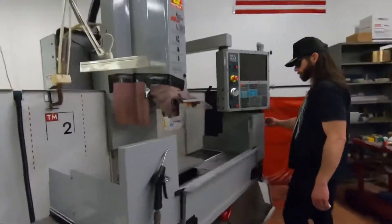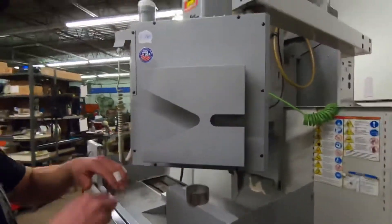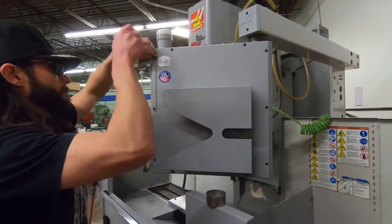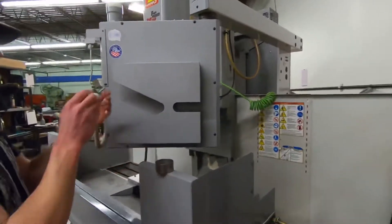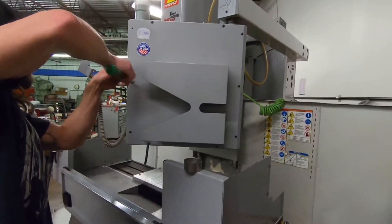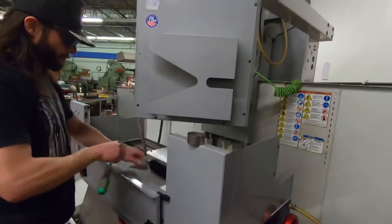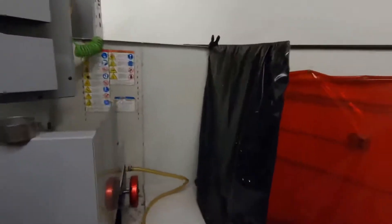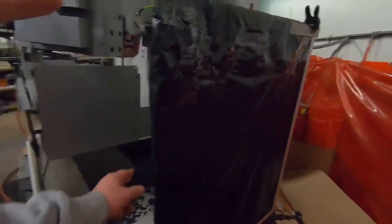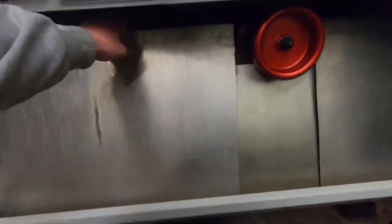What we're going to do is pull the panel apart and see if we can get the issue fixed. Obviously what you're going to do is just unscrew this back panel. While he's doing that, here's a couple of mods for you guys — kind of save yourself from making a big mess in your shop. Make a little curtain here for the side. The other thing is put some metal plates down here at the bottom to keep all that coolant off your legs — nothing fancy, just a couple little sheets of tin.